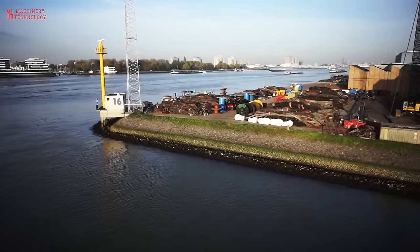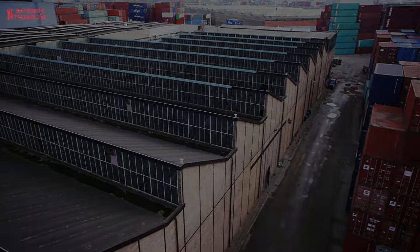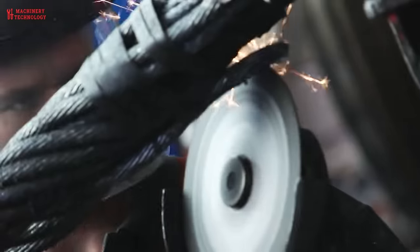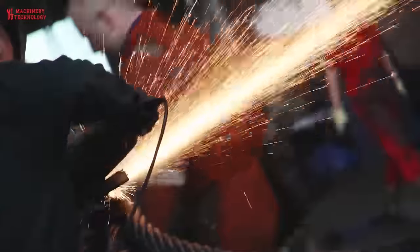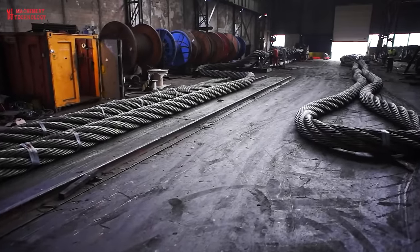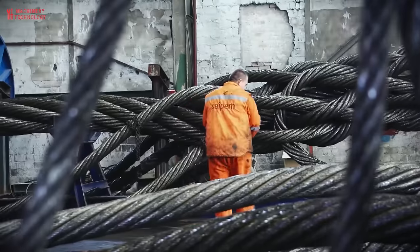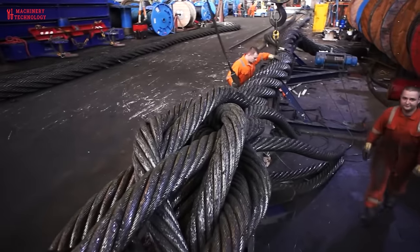Wire rope is composed of as few as two solid metal wires twisted into a helix that forms a composite rope in a pattern known as laid rope. Larger diameter wire rope consists of multiple strands of such laid rope in a pattern known as cable laid. Manufactured using an industrial machine known as a strander, the wires are fed through a series of barrels and spun into their final composite orientation.